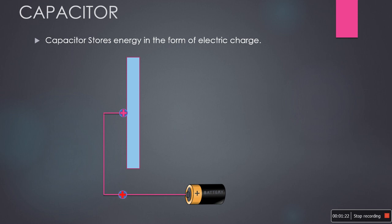Now what happens to the second charge? When it reaches the plate, it gets a repulsive force from the first charge. To overcome that, I need to apply more potential — I need to push this second charge to keep it along with the first charge. Like that, I may be able to store a few charges on this plate. The capacity of the material is defined as proportional to charge. If the material is able to store more amount of charge, we can say the metal has more capacity. If I need less potential — let's say I am applying 1.5 volts to store 5 or 10 charges on the plate — now how to improve this capacity?